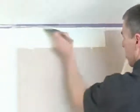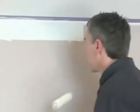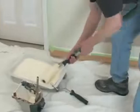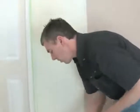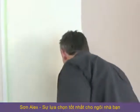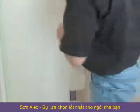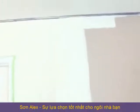Brushing, and see again, as we brush it in, we deteriorate the coverage. So my final move has to be to take that roller right back over top of that. Now typically when someone's brushing, or they've cut in the room, so to speak, prior to painting, and we start getting multiple layers of paint in those areas, you're going to get different levels of coverage, whether it was rolled, brushed and rolled, and maybe even double lap coated over a place that's already dry. And again, so we spread our paint. We want to quickly and lightly blend this into our wet paint behind us.